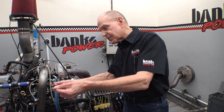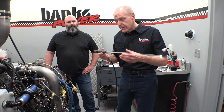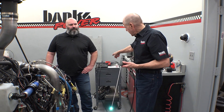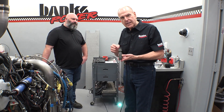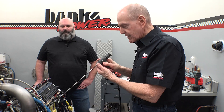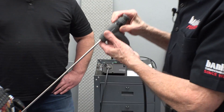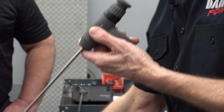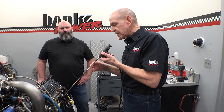That goes in number six — the last hole — and everything's looking good. What I'm doing here with this boroscope, made by Olympus, is it has a TV camera in the nose, with the guts of the television setup back here and a little eyepiece with a screen inside. I'm able to rotate the camera 360 degrees, going right through the injector bore, adjustable from 45 degrees down to 90 degrees straight out, and up to 115 degrees, which is 25 degrees upward.